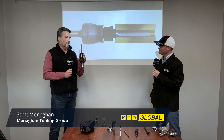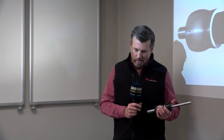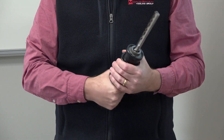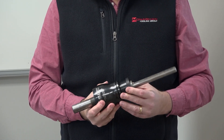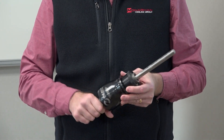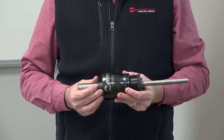What we have here is our IRU — the Internal Recessing Unit — made right here in Dayton, Ohio by Elliott Tool Technologies. We're their exclusive sales and marketing arm for worldwide sales. This product is highly engineered and very specific to this hydraulic control valve body application, where we are cutting multiple lands in a spool bore for hydraulic valves that control hydraulic fluid in backhoes, Caterpillars, John Deers, JCBs, and all kinds of heavy equipment. This tool does it all very quickly, in one shot, and very accurately.